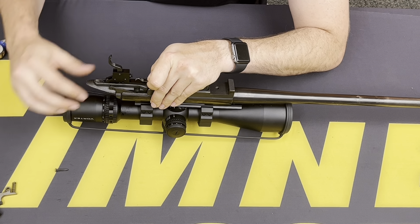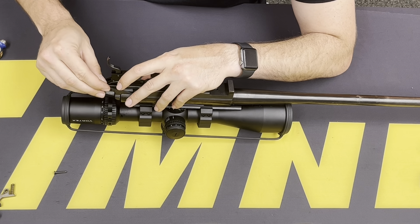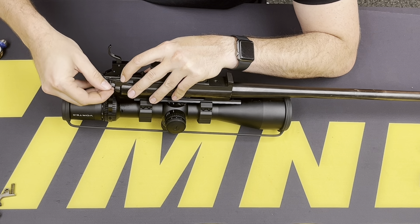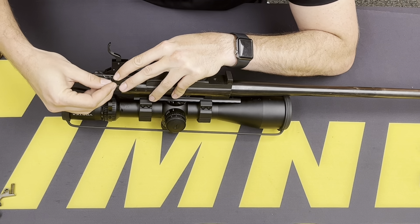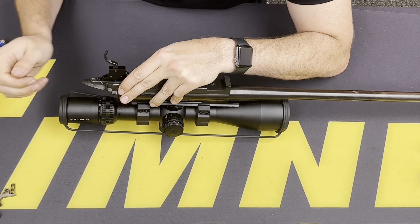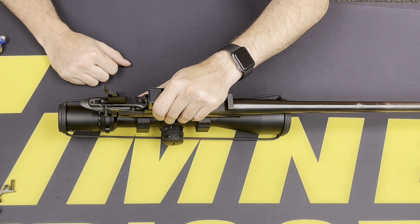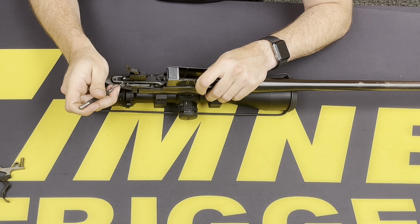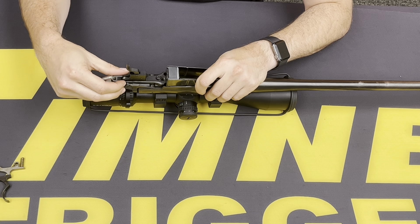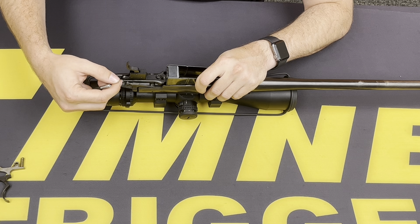The spring may need to be adjusted so it has a slight bend on the shorter leg here, just to clear the housing. When you line those up, the pin should be able to align with the hole. Get that started, and then this back hook can be pressed in. The rear pin and bolt stop spring may require a little more than just pushing the housing to snap it behind. We recommend using a pair of needle nose pliers — you can pull this leg back and around.